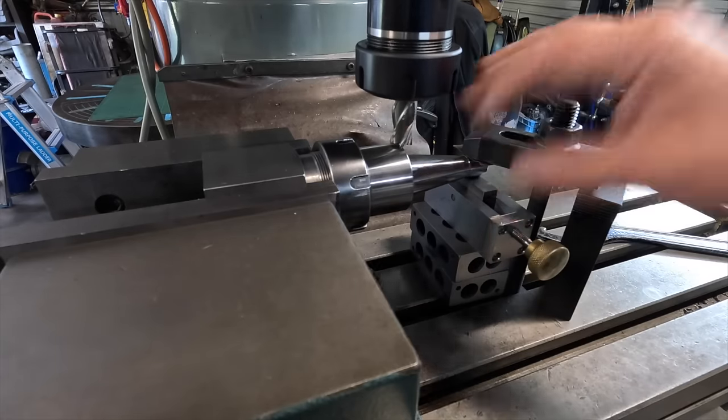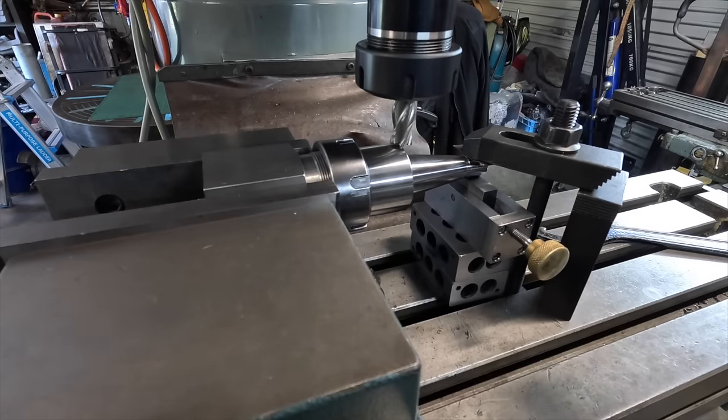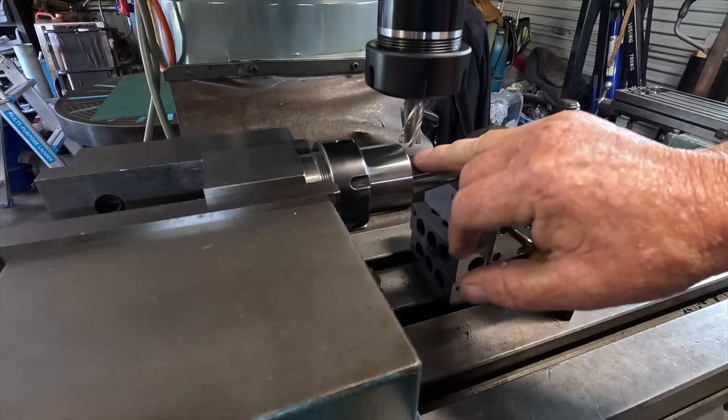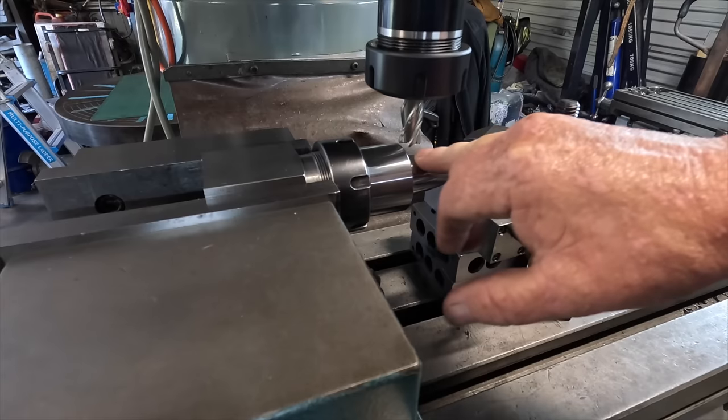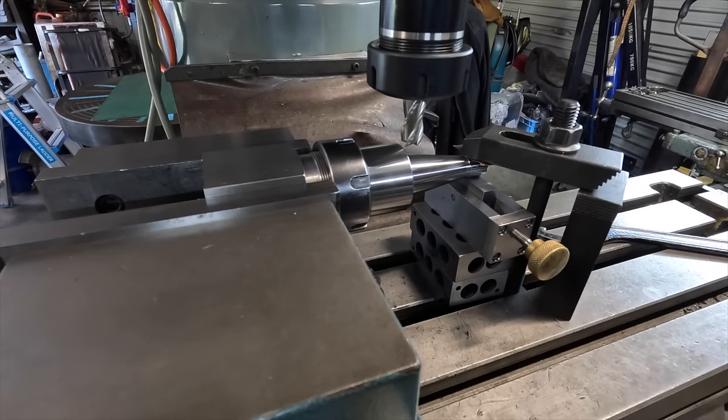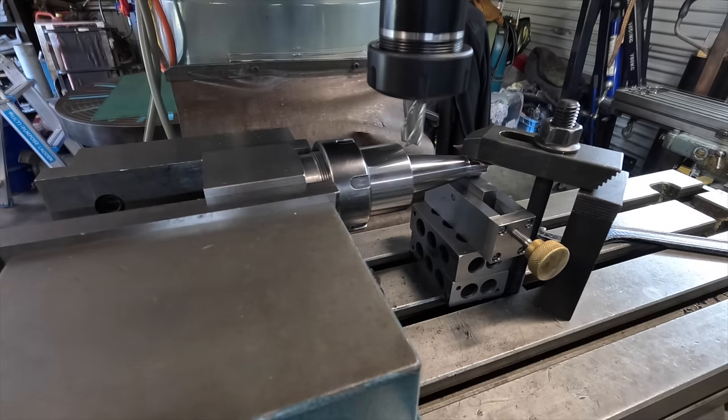5/8 cutter, I'm going to have to shift over each way a fraction. I'm just going to do the adjustments with the knee, because that's what I'm used to. These slots have to go down till it touches the taper, basically. Certainly back to basics when you're playing with hand wheels again. I've done it for years on the lathe, I've done it for ages on the Cincinnati. I thought I'll never have to do that again.